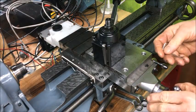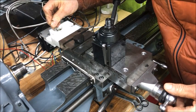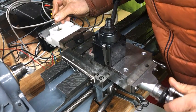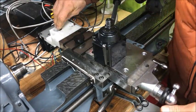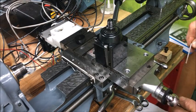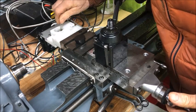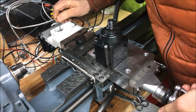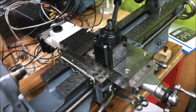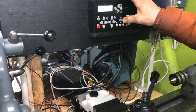To the rear of this, I have the possibility to undo the stepper motor altogether so that I can retain the silky smooth operation. And when I want to switch it back in again, I just tighten the set screws. The normal way I switch it on and off is by the x-off and x-on controls.